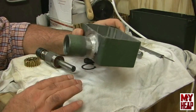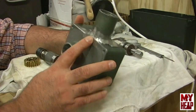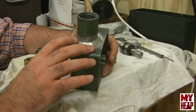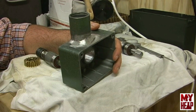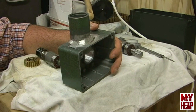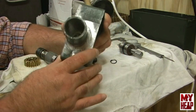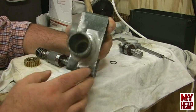When I got the saw and it had been dropped, this part right here was snapped off. My son said, why don't you let me take that to work with me — we have some pretty good welders, maybe they can do something with it. He called me back and said he didn't think anybody there was going to be able to fix it. Then a subscriber suggested I could get some aluminum brazing rod and maybe braze it that way. I was thinking about brazing around it and then putting it in the lathe, boring it, putting a steel sleeve in, and re-boring the inside.